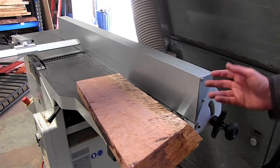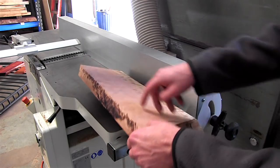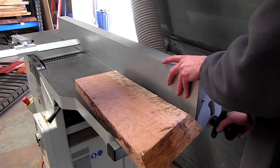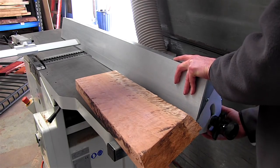As is always the way, I've changed my mind again. What I'm going to do is put a very slight angle onto this straight edge, so instead of it being 90 degrees we'll take it to maybe 70 or so. I'm just going to do that at the jointer by angling the fence.